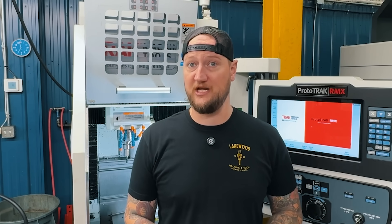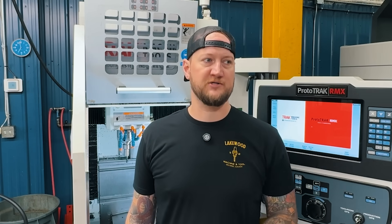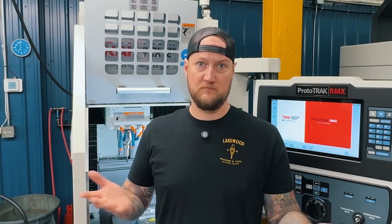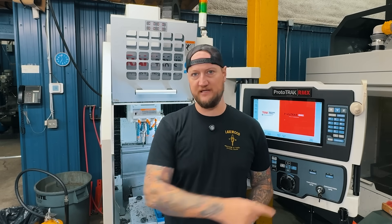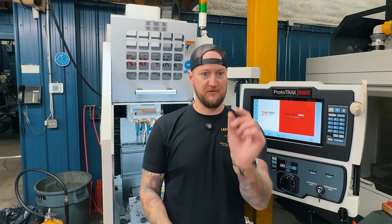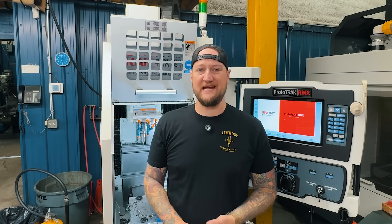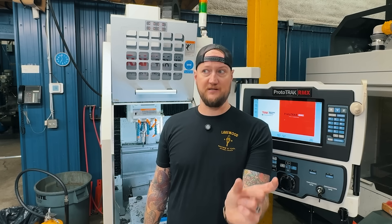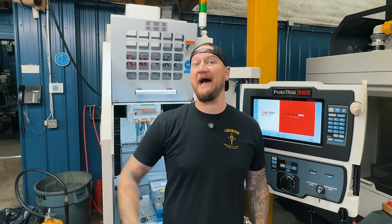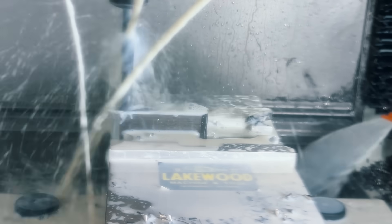Typically minimum 40-inch table all the way up to 60-inch table in the X. That works really well for big stuff; it works well for small stuff if we're setting up multiple vises, or if we want to do multiple ops. But especially on my biggest mill — it's an XT — it's got a huge travel in Z, X, and Y. When we're doing small parts, some of them can be this big. Not only are we wasting that table, what am I going to do — set up eight vises to run one part when it's a 30-second cycle? And because of the travels it's taking a lot longer. We'd be running a small part in that machine, then all of a sudden bigger work comes in that has to run on that machine, and now it's waiting. We're late or rushed because that machine that can only do big stuff is currently tied up doing small stuff.